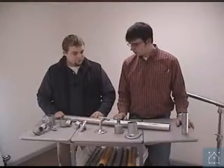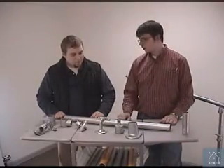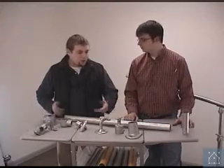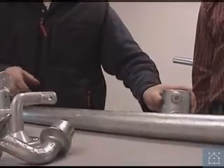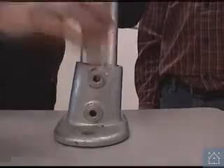Let's talk a little bit about the base. Let's start at the bottom and work our way up. We want to fix this thing to cement on a ramp or stairway. There are a few different types of base flanges that you can use. The one we have here is a base flange that allows you to go anywhere from completely plumb to your stairway or ramp, and also allows you to go up to 11 degrees off plumb.